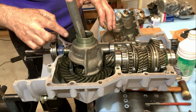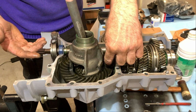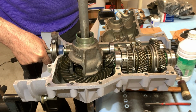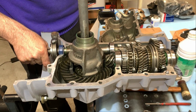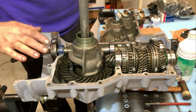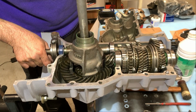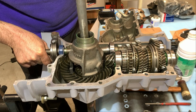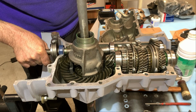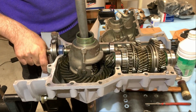These distance rings, normally you have to measure up to keep the differential in place, to get the play away, but like you see, it sits in place and I really don't have any play here. If it sits too low, you would see that this little gear will stay a little bit in place, but here you see the minimum I turn, it turns also, so I don't have play. That's a good sign.